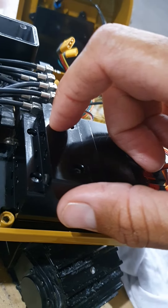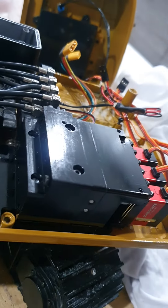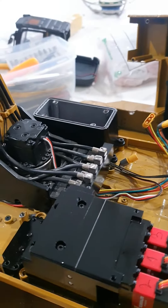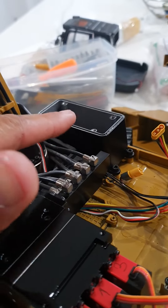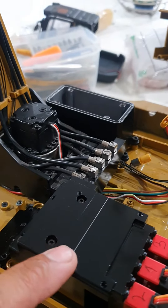What I'm going to do is back them out one at a time, put some blue threadlock on each one, re-crank them, and hopefully that does the trick. Hope this helps anyone that finds any leaks. I noticed there weren't any leaks at the tank or at the pump — just at the valve block right here at the sandwich plate.